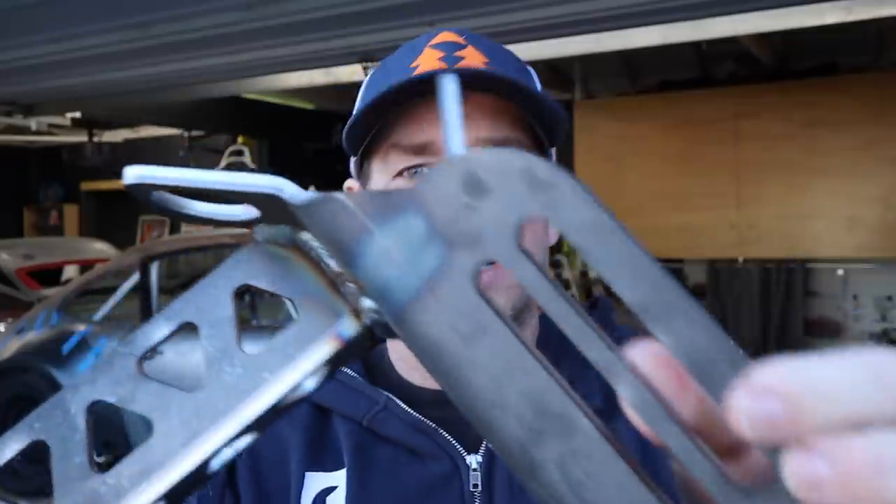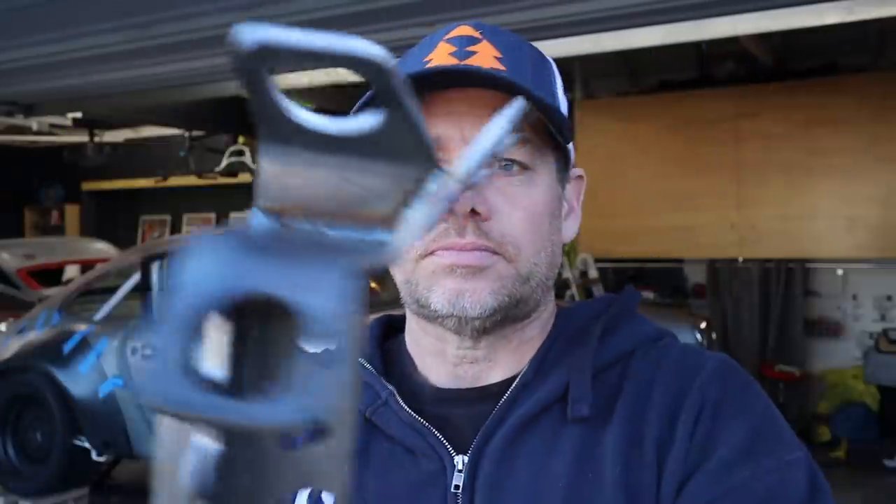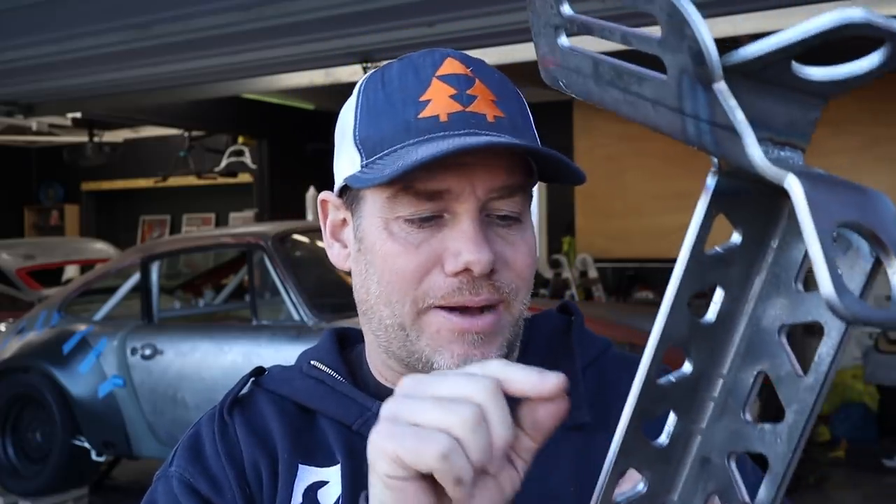So here is this beautiful piece of kit — a laser-cut engine cradle. Look at this with all the wacky angles I was talking about. He's made holes for inch-and-a-half tubing. The idea is I have to bolt this thing up and then just run tubing to the hard mounts I've created, both on the transmission and the engine side. The problem is, because this is a prototype, it ended up being about a half inch shorter than it needs to be.